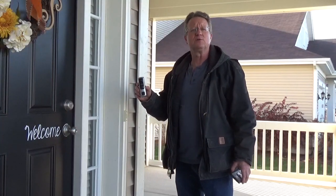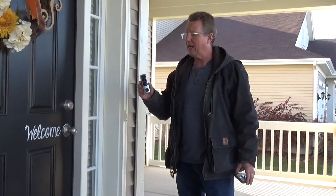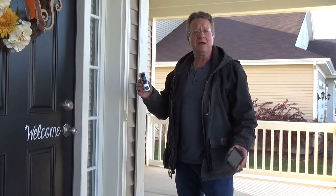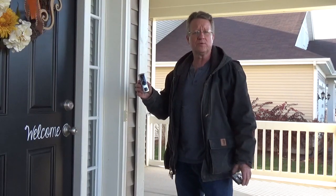I'm going to be installing the Scout video doorbell, and they have either an analog or a digital style. This is their analog style, and you need to know whether you have a 16 or 24 volt chime — it doesn't work with the 8 volt chimes.